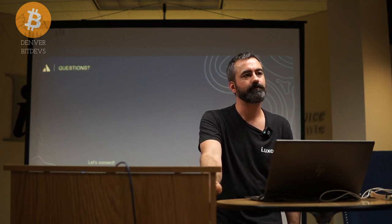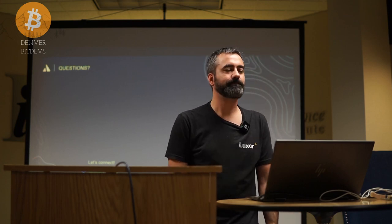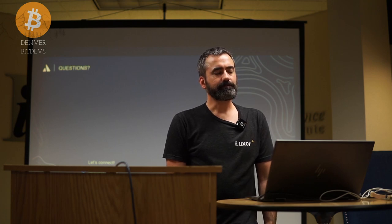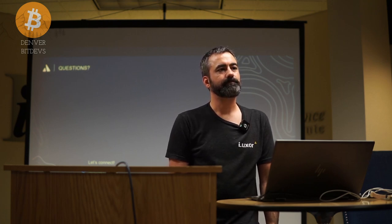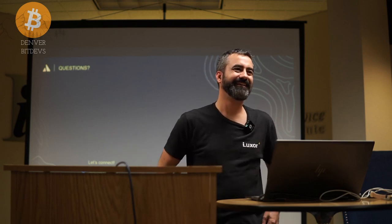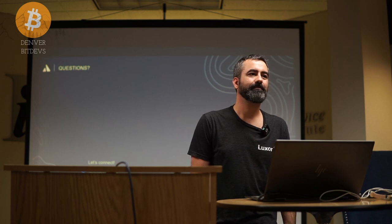And with a lot of the incumbents and the folks in the space, I think firmware is one of those things that is easy to not appreciate enough. Because from a consumer standpoint, as a miner, you're kind of Cro-Magnon. Plug it in, does it run? If it's not running, whose fault is it? But the idea that you have to voltage tune 100-some odd chips per board and make it responsive to ambient conditions and make it not blow itself up and be stable and have all the internal failsafes on something that you didn't build. Yeah, and we don't have data sheets for. And there's no data sheets, and every different manufacturer is writing it with a different code base. Yep. And their component structures are all different. So it's kind of bonkers, actually.